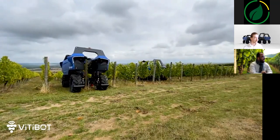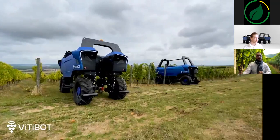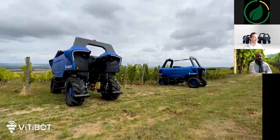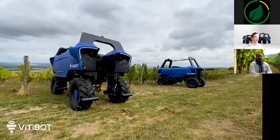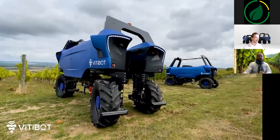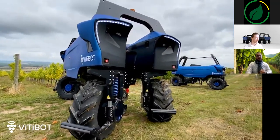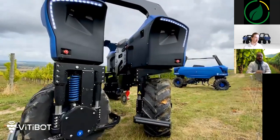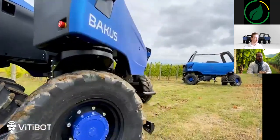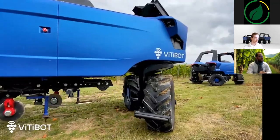You will see the tool loader pole raised on the two robots now. The robot also has a turtle mode and a crab mode, allowing it to perform more complex movements when the situation requires it. The robot carries out all of its movements autonomously. It's equipped with GPS RTK giving it an accuracy of a few centimeters. We simply carry out a study of the plot and a cartography to allow this trip in total autonomy.